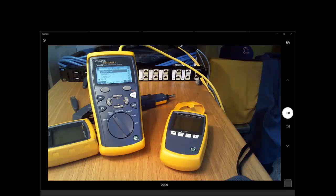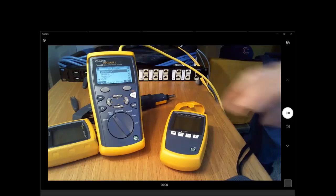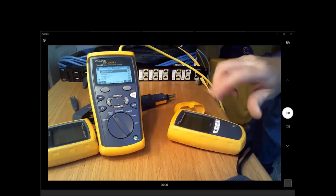The one thing you do need to be a little bit more cautious about is if you're using something that is not IEEE standard, which could be either the switch or more likely some sort of injection device along the way. Those can put out power all the time continuously, and they don't necessarily care whether there's a device at the far end or not.